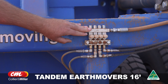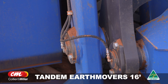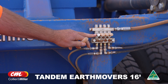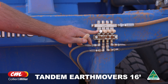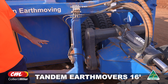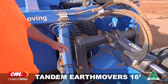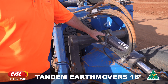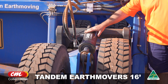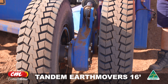We have another grease point here for the rocker axle pins and bushes. Every time we shut the apron, the whole bucket gets a grease. They're all adjustable grease nipples — you can dial them up from 0.06 of a cc up to 0.66 of a cc, dialing up or down depending on the amount of grease needed for each point. Same with the cross-leveler rams — everything gets greased. Locally made rams by Camden Lane in Tamworth. No better quality for lift rams, bowl rams, and cross-leveler rams.